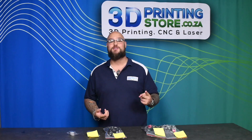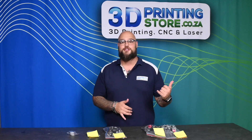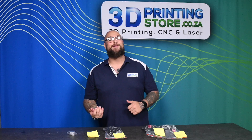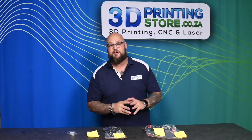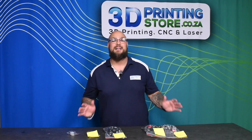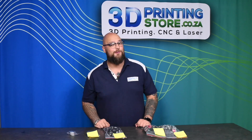The reason why we're using those two filaments: black is the most difficult color to get out of the extruder when you're changing colors, and white is the most susceptible to being influenced by other colors. In this video I'm going to show you a few different ways of how you can slice your multi-color file and see how you can change your filament wastage and which way really works for you.